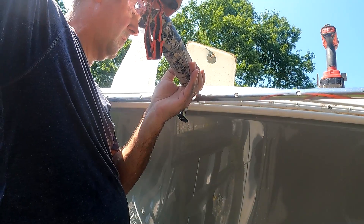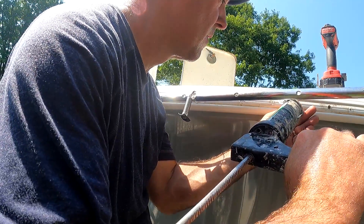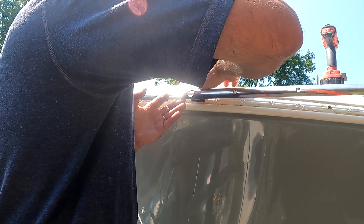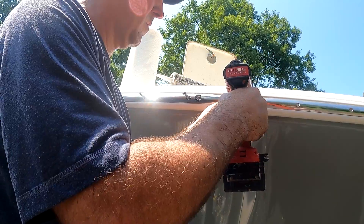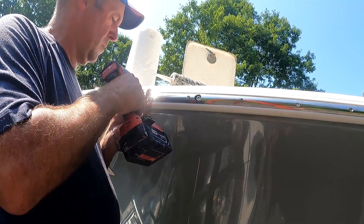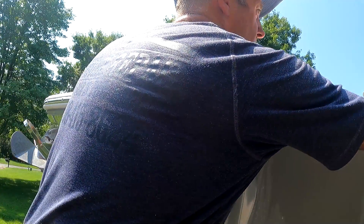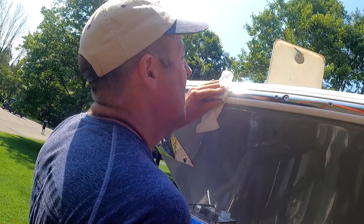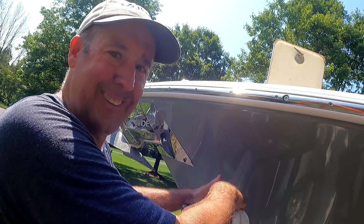Apply your favorite marine-grade silicone to the socket that you've created in the rub rail, and don't forget to put a dab in each one of the screw holes. Here I'm tucking the nav light into the rub rail for the last time. If you don't like how your silicone is bedding up, feel free to put some more in at this time. The last thing to do is to put the screws back in — the rub rail is very fragile where the big hole is, so make sure you ease it back into its original position and snug up your screws.